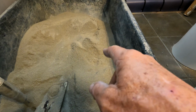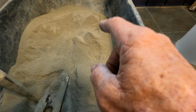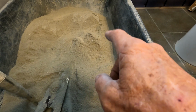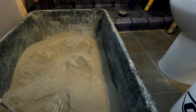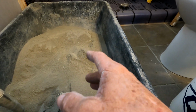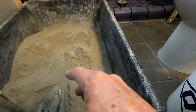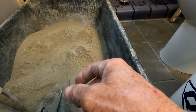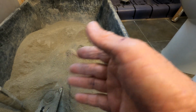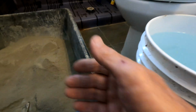And also mortar is generally going to be used for brick and stuff like that. So the recipe that they're giving you, what they're telling you on the bag, is a lot different than what we're doing with the pan mortar, right? So the pan mortar specifically is what we're using it for. If you're using it on your driveway to seal cracks, you would want it much richer, more water the better. So depending on the use, that's when the water thing kicks in.